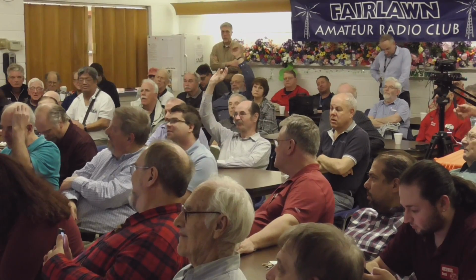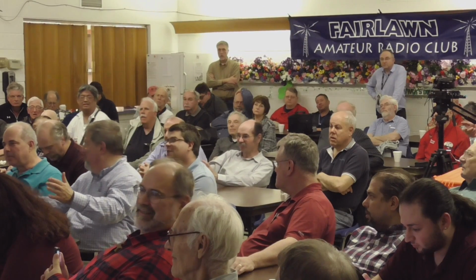And there are big stations in Europe. HB9Q is one of them. He's got a fairly sizable dish, and he loves working single Yagi stations with 100 watts or less. If you can see the moon off your balcony and have a 6-foot-long Yagi on 432, you can work him. And 100 watts? Yeah, with 100 watts. Outstanding. Yeah, it's cool.